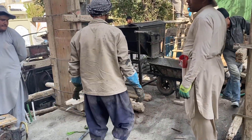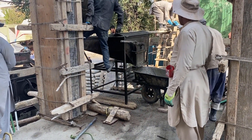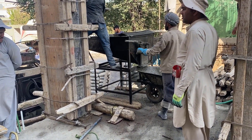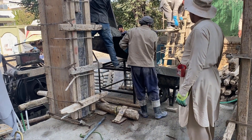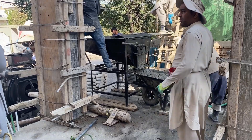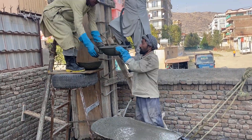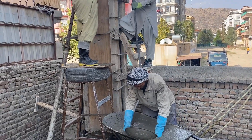In order to make sure that the concrete is evenly distributed in the height of the column, and to remove any air pockets, we use vibrators to vibrate the concrete and make sure all the gaps are filled within the concrete.